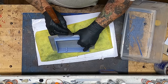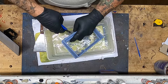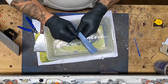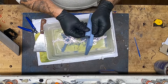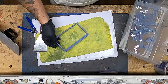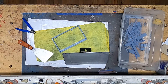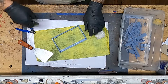Slowly work your way around the frame — there's no support in the middle so you can deform it pretty easily. We'll snip the raft around the whole perimeter of the door frame and peel those supports off nice and easy. Nothing worse than printing something for six hours and ruining it because you were too quick removing supports. Go ahead and scrape the build plate to make sure there are no stray pieces that could puncture the FEP on the next print.